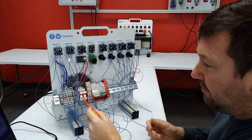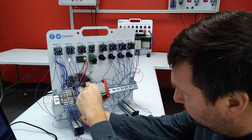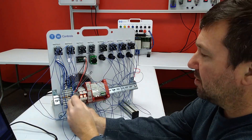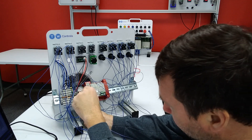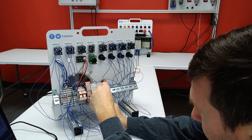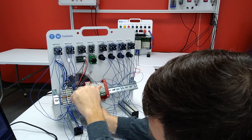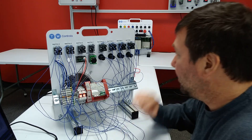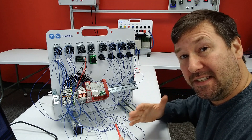Now we're going to connect our two safety relays. We're going to start by connecting their common wires which are A2 — putting a wire into A2, the bottom left terminal of both of them, and connecting these to the zero volt, our right set of terminals. Then I'm going to connect a wire to A1 of our left safety relay and connect it to terminal 14 on the bottom of our PLC. Then a wire from A1 of the right safety relay goes to terminal 15 on the bottom of our PLC. Now terminals 16 and 17 are going to go to the drive, so instead of flipping back and forth I'm going to wait and finish wiring everything over here — I'm just going to move my PLC over so you can see exactly what I'm doing.